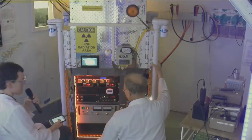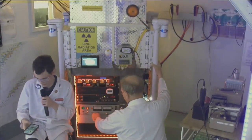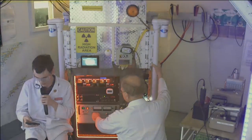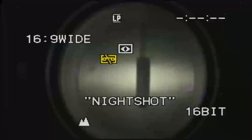So as the reactor turns on, the plasma inside, which we'll switch back to that lovely plasma view, if I can get my control panel on my phone opened up again. The plasma inside is starting to clean the vessel walls off, and while doing that, it's introducing a lot of stuff that's not deuterium into the beamline. That starts to poison the reaction. So we're slowly ramping up voltage and currents to the point where we can get that burnt off, so we can increase voltage again and get more energy going into just the deuterium.